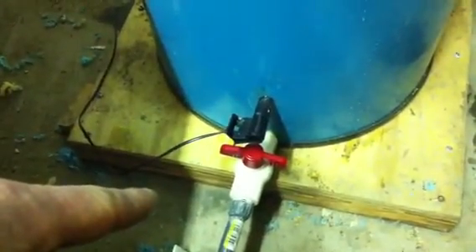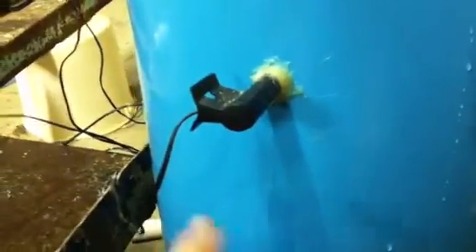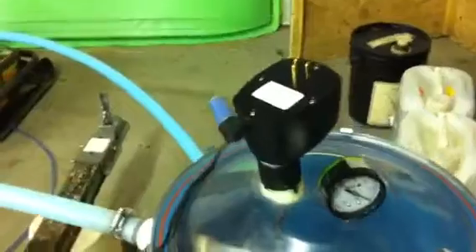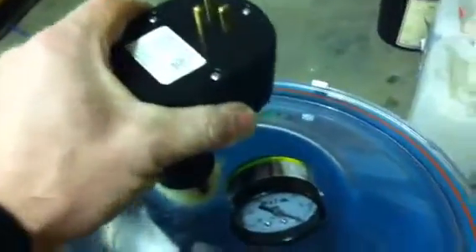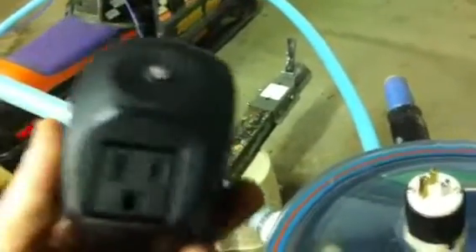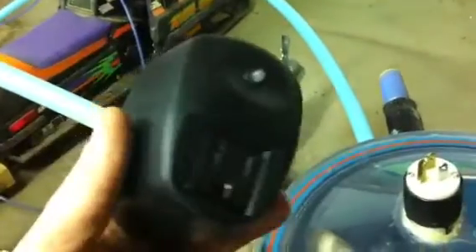To tell you a little bit about the switches, I decided to use a continuity switch, which is an electrical switch. Basically, sap will cover up the bottom switch, it will start up the circuit, it will rise until it hits the top switch. The top switch will kick the pump on and the booster will start pumping out until it goes below my lower float switch. Looking at the top of my continuity switch, it's just a three prong plug — you plug it into a regular outlet, really simple, impossible to really screw it up.